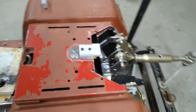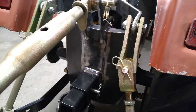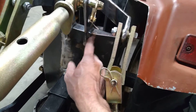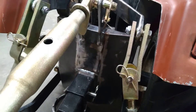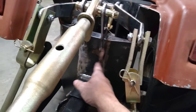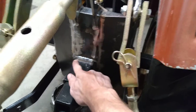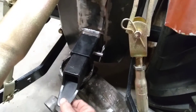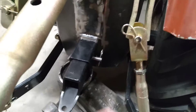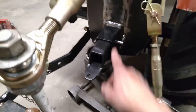The other part is the three-point. I got all this finished — I needed to make this panel back here. That's quarter-inch steel, just one solid piece. I bent these flanges by hand: I scored the other side with my cutoff wheel until there was about a sixteenth of an inch gap left, cut some sections all the way through, and bent it back by hand. Then I put the top plates on for the top link and welded on the receiver hitch — that's where my lawn mower connects. It's welded on both sides so it's not going anywhere.